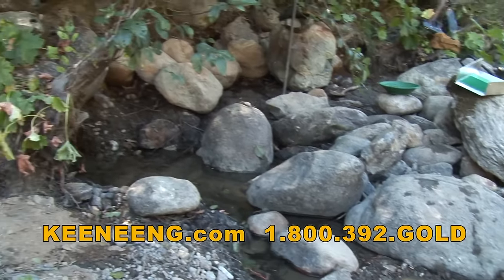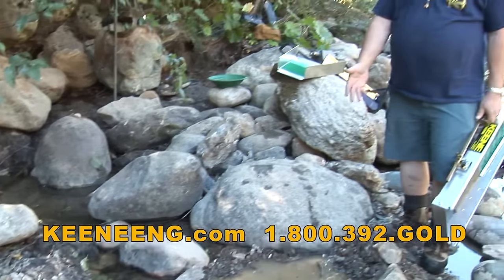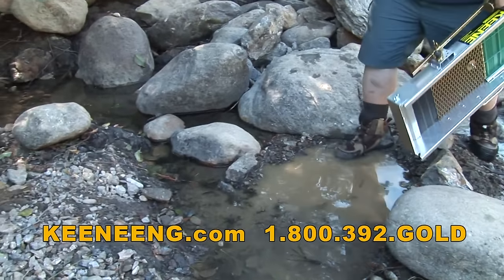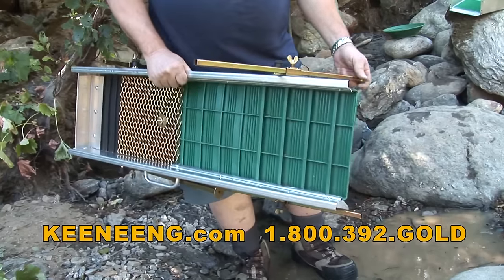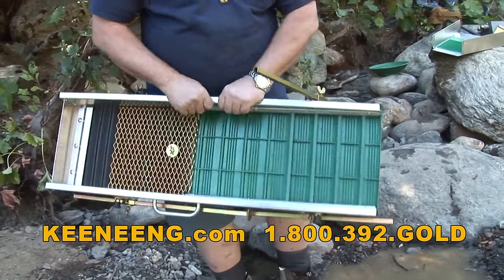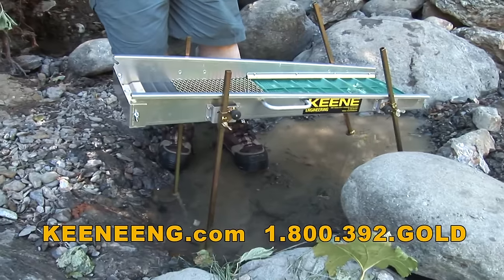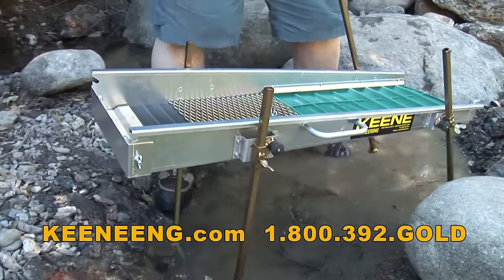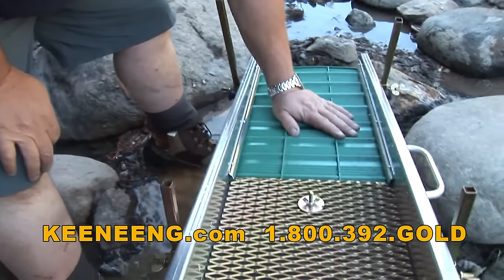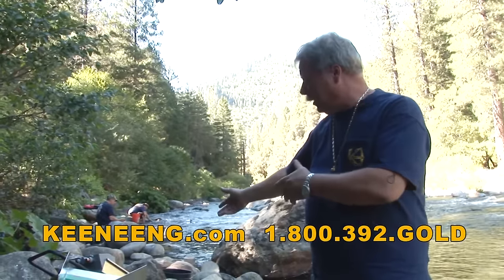This looks like a perfect little place to make a little dam and create a little settling pond. We've got a natural flow of water coming up out of the hillside coming down here, and we can use this because it won't let any of the dirty water back into the stream. We're going to set this thing up now. I like to cant the first set of legs out a bit - snaps into place. Do the same on this side, make sure you're good and stable. The tilt of this unit - you can actually run a pretty good-sized tilt, maybe three-quarters of an inch to an inch per foot.